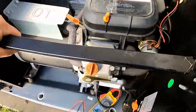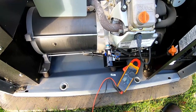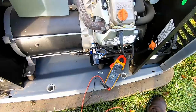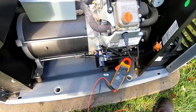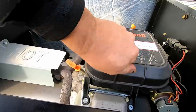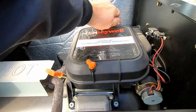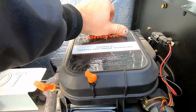Let's go ahead and start it back. That's going to be a simple troubleshooting procedure here on one of the Generac generators. This is not a very common issue — basically it's just a regular oil pressure switch that's normally grounded when not running and opens from ground when it is running. We verified we had pressure with the oil pressure gauge, checked the battery and got that cleaned up. It's the little things that cause problems down the road, so you want to make sure you always check everything out.